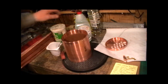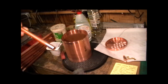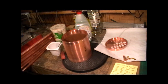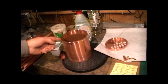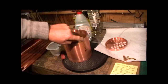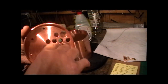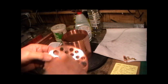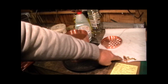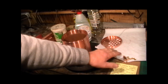I've cleaned all my joints up, all the tube ends have all had a good clean, and they're all aside here. I've got the inner firebox inside all cleaned, and the holes where the screw rivets go. I've got the tube plate all cleaned up, and all the holes inside cleaned, and everything spotless. That's all ready. And down here, I've got the stays and the nuts and the rivets all degreased and clean.